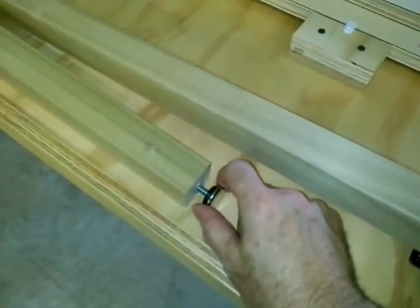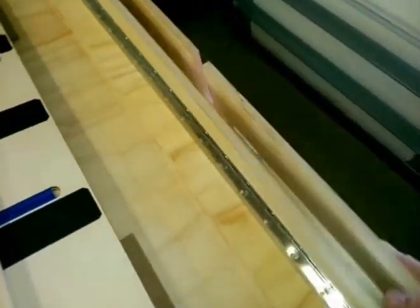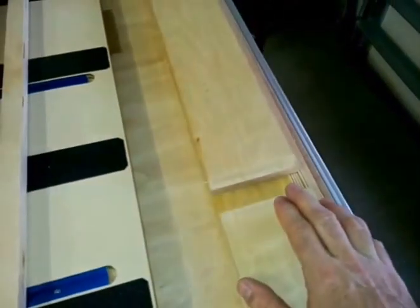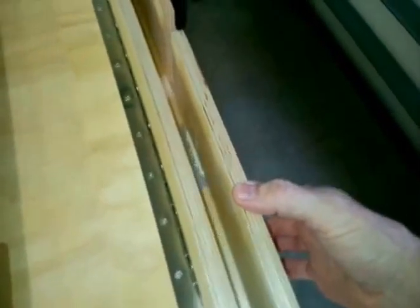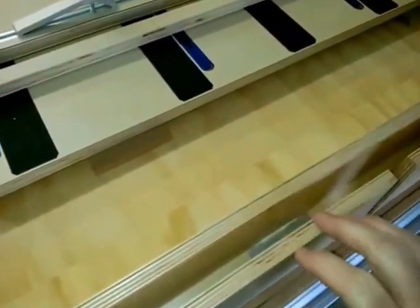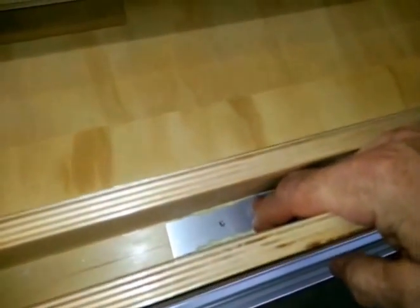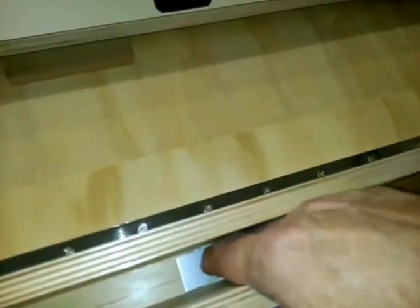As you see right here, I have a leveler adjustment on both feet for adjusting the far side of the outfeed table. This part up here I call my sleeve — it's on a four-foot piano hinge. This is what goes over what I call my rail system, and these are the two cutouts right here and one over there that go over the arms coming out from the table saw — it just slides right on over. I made it a little extra deep, about four inches, so as I'm raising it I've got more stability inside. Inside you can see what I call my strike plates — that's where my risers, when adjusting to raise and lower, strike this aluminum plate. It was just an aluminum clipboard that I cut down and set in there with polyurethane glue so it wasn't digging into wood, preventing it from bedding in and coming out of adjustment over time. This helps distribute the load, and I have one on both sides.